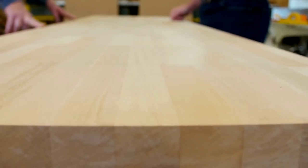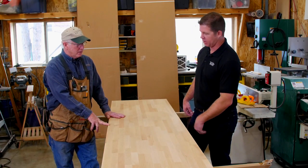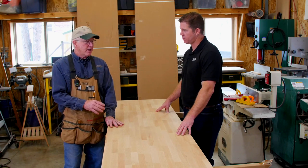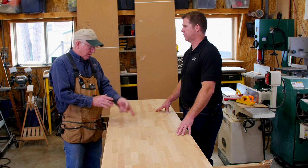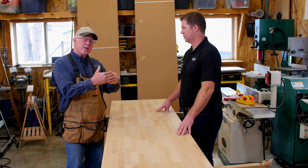On these beech blocks, they come with sharp 90-degree corners. What are you going to use to knock these down? I'll use an eighth-inch round-over bit in my router. And again, I'll do it after it's assembled, because when you go into a corner it'll take your corner right around with it. If you went past it, you would have a notch.